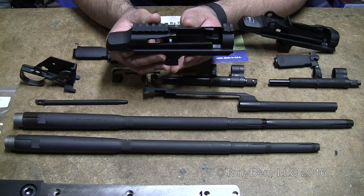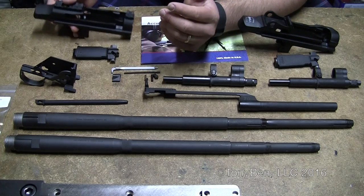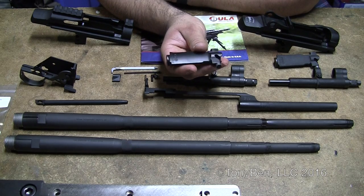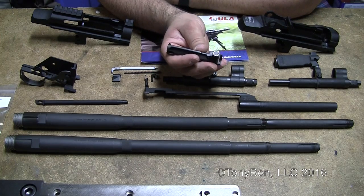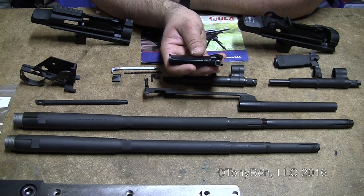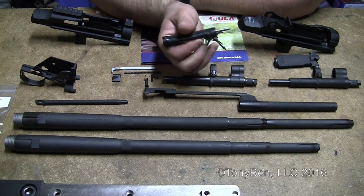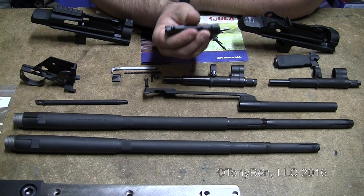It's just another option for home M14 builders, or for people who want one built — something a little different. You've got basically a mil-spec hammer-forged bolt. This is their latest one that's got a B2 lock coat on it. They seem to be really good bolts. I've got these both fitted to these receivers now, and they pretty much went on like any other bolt that I'd fit to any other receiver. I haven't really seen anything wrong with them yet. Once I get them built, we'll try them out and see how they do. I also checked the helix angles on the receivers and they look good.